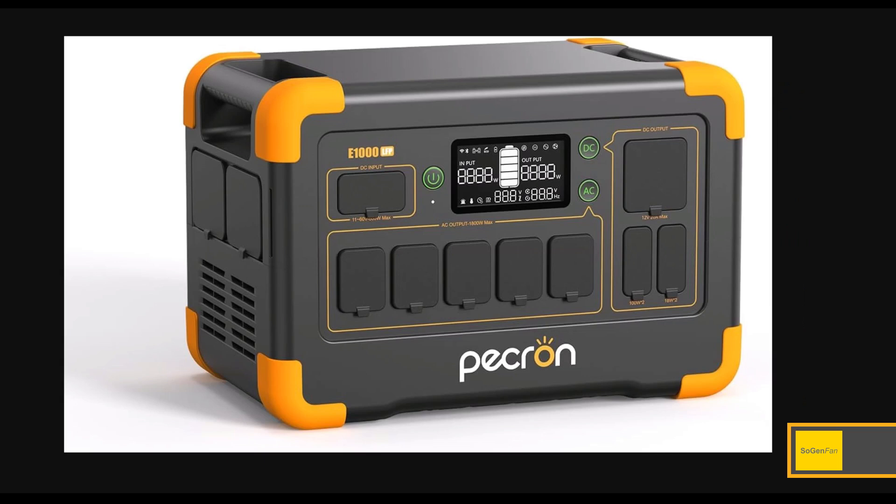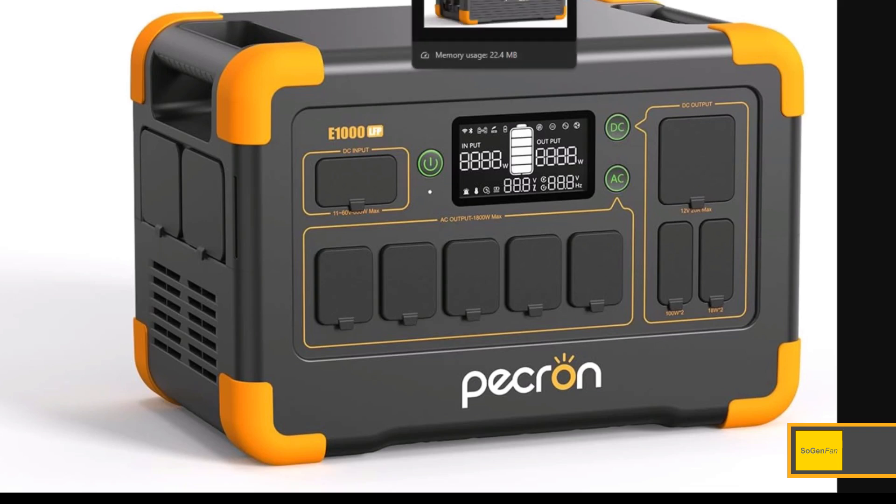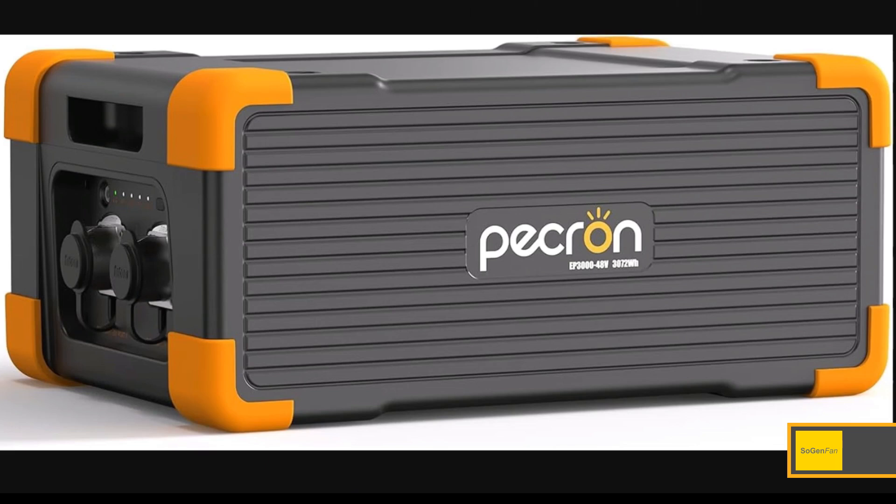At 29 pounds you can take this unit anywhere. It has an 1,800-watt inverter, which is essentially the same as your wall outlets. That's what enables you to use it properly for home backup. You're not going to power multiple big loads at the same time or anything 240 volts, but this will cover the basics — you'll have power and be able to plug in your normal stuff even when the power is out. And again, what's awesome is the option to expand it to four kilowatt-hours with just one battery and one cable.